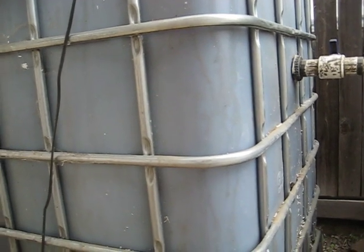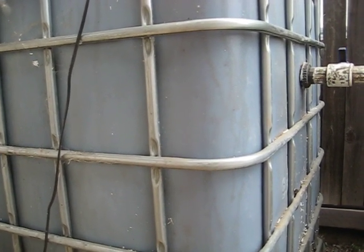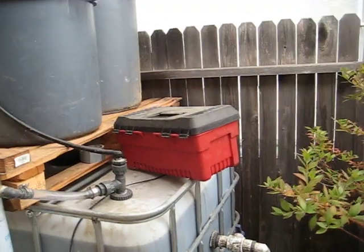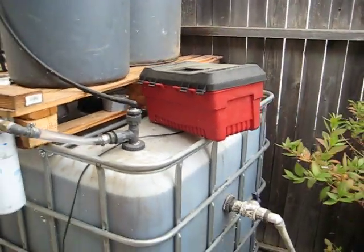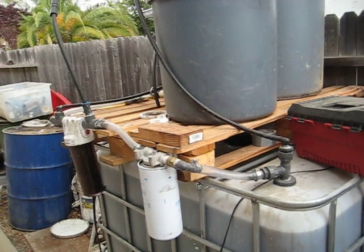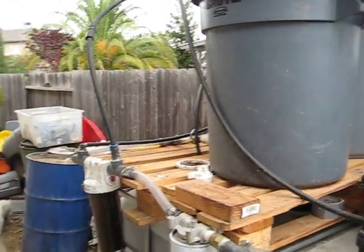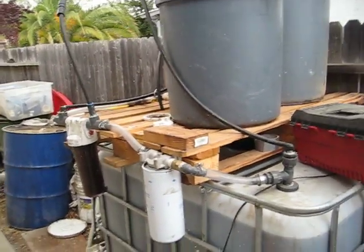This unit is outside. It heats up to about 70–80 degrees during fall and spring, over 100 in summer, and about 70 degrees in winter. That actually helps the water settle as well. This system is called upflow settling — it actually settles while it's going up, cold, with no heat applied other than the sun. I also use gravity filtration. I had no idea when I first started, but I saw some simple gravity kits and was amazed at how quickly the oil can flow with just gravity. A little warm outside and with clean oil, I can filter about 50 gallons in less than 48 hours.